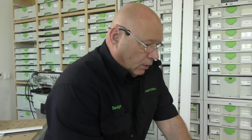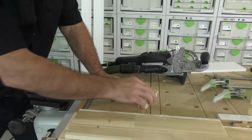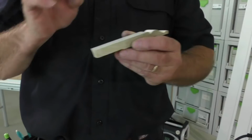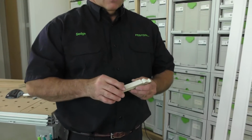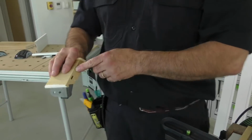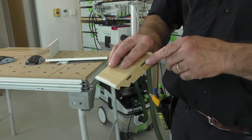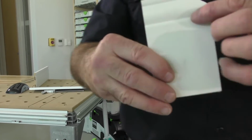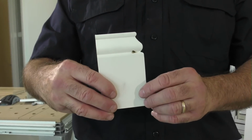Okay? So, important to know that when you're doing this bevel, you've got to know your molding and where you're going to use your flaps and how you're going to index it. This gives you perfect alignment until glue sets up. And I have a sample here. If I used the 37 like this on the bevel, and did my 2 tenons like this, 4mm tenons, from the front, I'd have to get some of that putty in there, right? Because I had blow through.